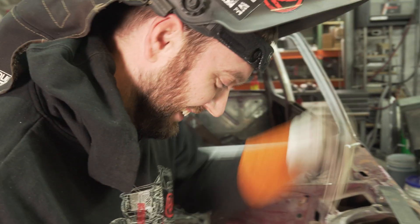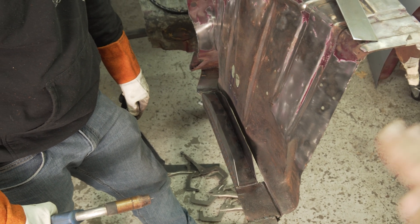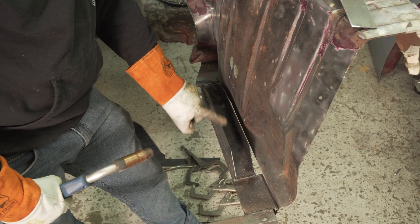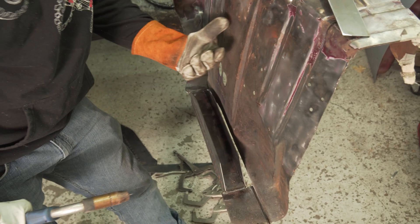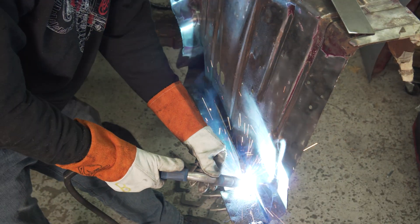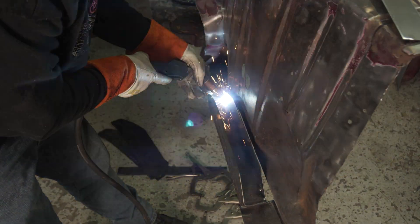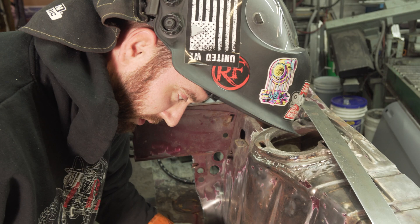This is kind of rough-balling it. I think it's going to be fine because these aren't really dimensionally critical. The critical dimension is just how far we're going to go. We'll put it off of this plate and bring it over and it'll hit the edge of this plate, and then we'll just grind that off and then it'll match up. Note to everybody on YouTube: maybe do all of your tacks on one side before you put the other side on — it'll get you a better angle on your torch.